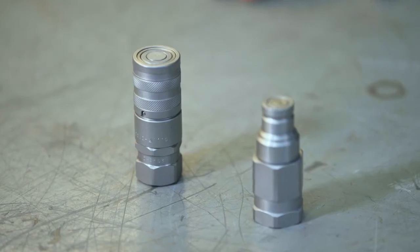There are a couple of reasons why replacing the complete quick release coupling is more advantageous than just replacing the o-ring and the backup ring. If your coupling is old and worn from years of service, replacing the complete coupling might be the way to go. In the end it'll be more economical and you'll have brand new material you can rely on. You can use the information you gathered in step one to find the right male and female part.